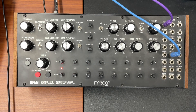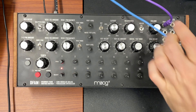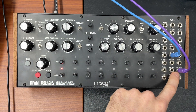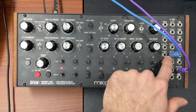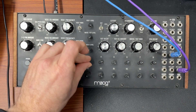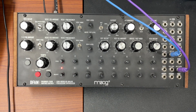An interesting thing you can think about is that you can separate all this out. I can use a clock out of my sequencer instead of a gate out. At this point this becomes live — we're going to use the clock from the sequencer to advance this. What that gains us is I can control the pitch of VCO one completely independently of whatever's happening here. I can have a 16-step sequence running here and an eight-step sequence running into VCO two, and we get all this interesting stuff happening.